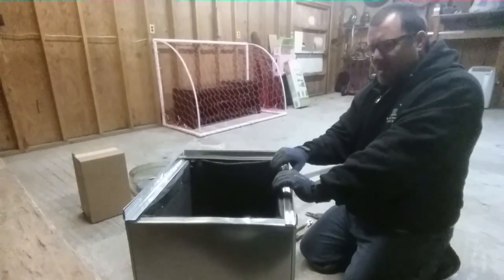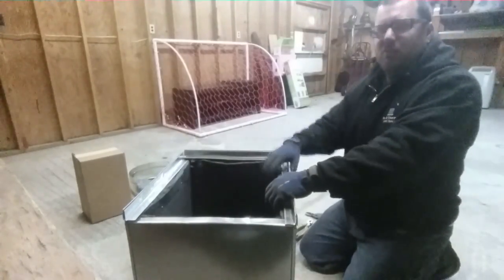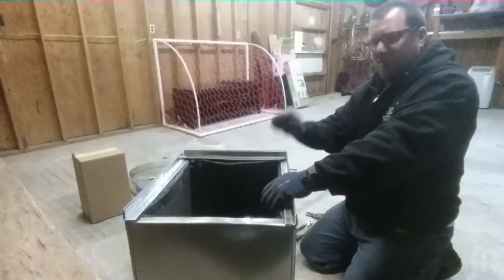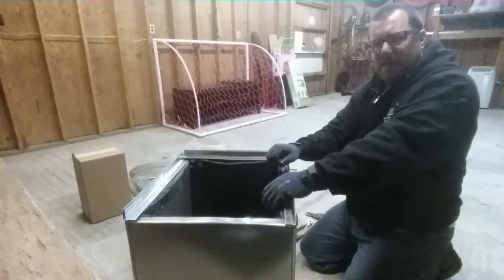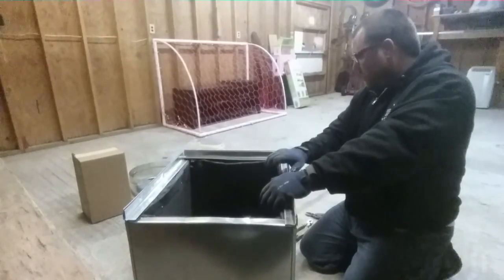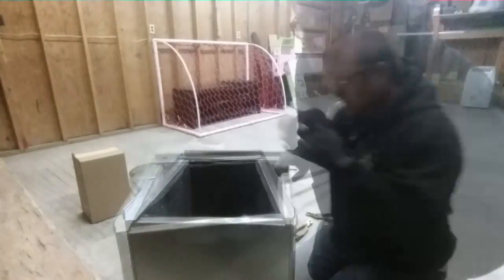No harm no foul — I'll tape it up, and that's a basic base box conversion. Pretty easy stuff. You can cut the standing S-lock so it folds around all three sides, but I just cut three pieces and I'm going to tape it all up anyway, so it's no big deal. If you want to make some calculated cuts, you can probably make it look a little bit better. It's a simple job so you can sit the air handler on top in a stand-up attic, which is kind of rare here — usually we're all horizontal in the attic.